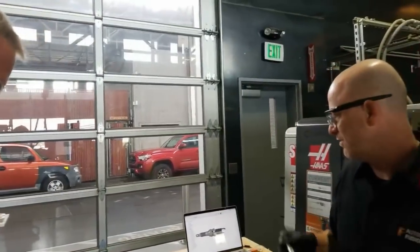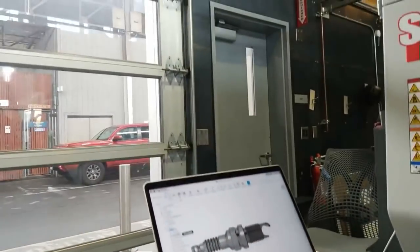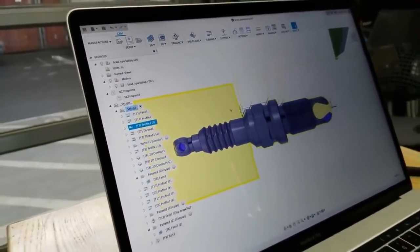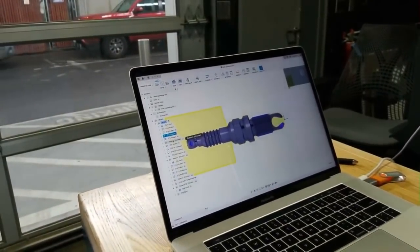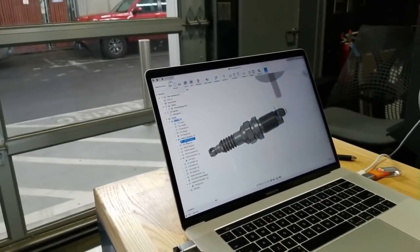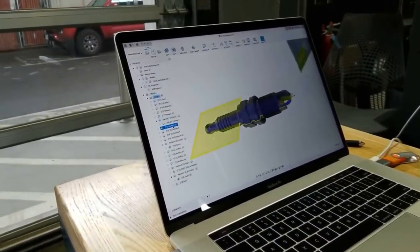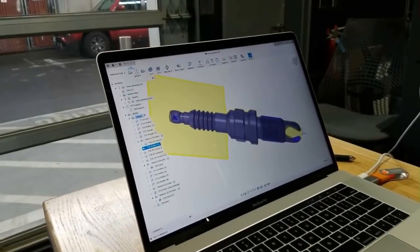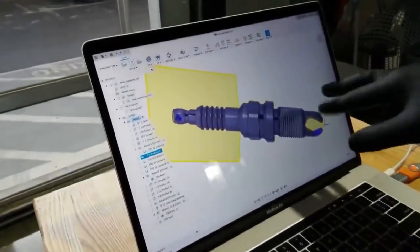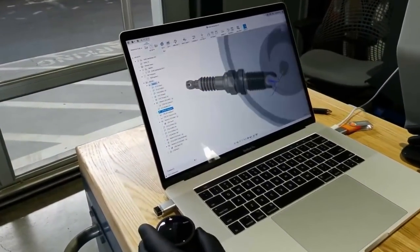If you remember the other day, we assigned some toolpaths. I did change some of the ordering on some things. We got the facing, and then we profiled and came down in these areas here. I got some threading, and let me open this one up. Here I machined the flats, and then I did a circular pattern, so it puts it on both sides. After that I did what we call a spring pass to clean up all of this area here. After you do some turning and some of the milling features, it kicks up a very slight burr, so I just trace over it really quick. And over here I cut out the bottle opener portion.